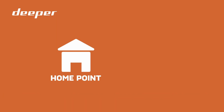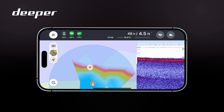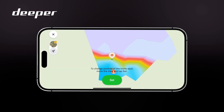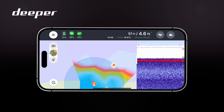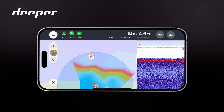The home point of the Deeper Quest is automatically set when the boat is placed in the water. Through a recent app update, you can now save your own manual home point. To change this, go to the map view, locate the home icon, tap and hold it for around two seconds, and a new menu will appear at the bottom of the screen with the option to set. Drag the map to the location where you want the new home spot to be, tap set, and the new home point will be stored. These steps must be carried out before you attempt any autopilot mission — you cannot set the home point while your Quest is completing a mission.